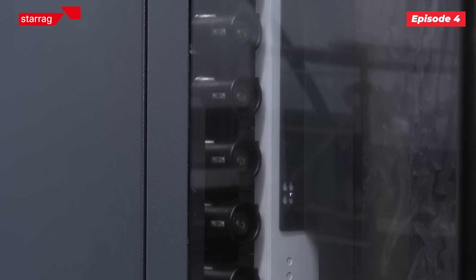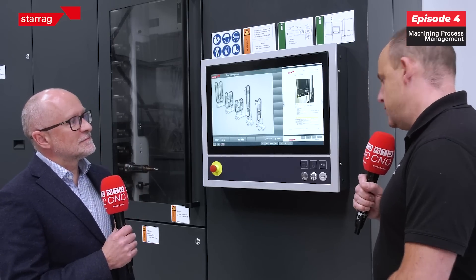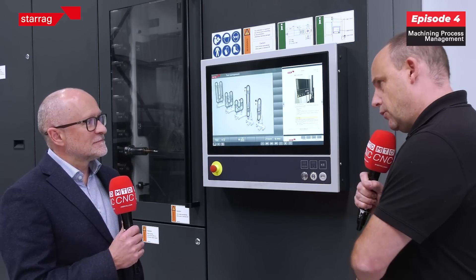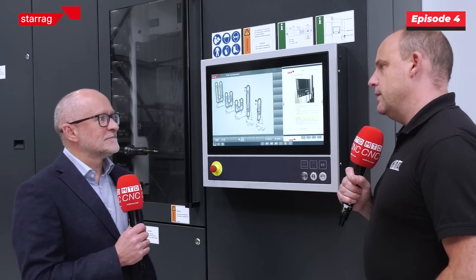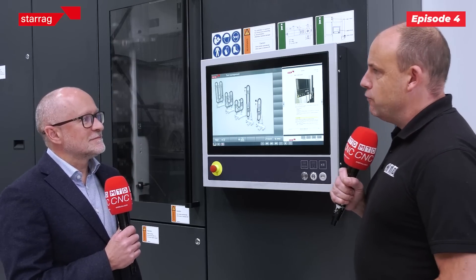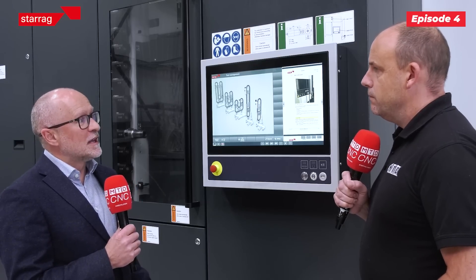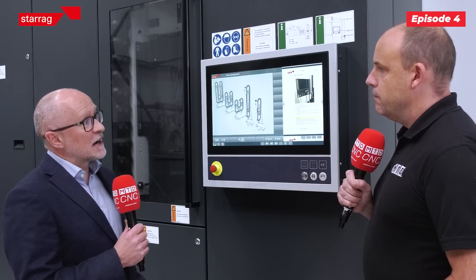It's all about ease of use, functionality, and continuous operation of the machine. Now we've got a lot of tools on this machine, and the recording of tool sizes is done through the ball chip — but what about fail safes to ensure that wrong tools aren't selected and accidents don't happen? That's why the chip system works so well: when you measure and set the tool, you're loading it with data that the machine reads. You're not relying on an operator punching numbers in and maybe putting a decimal point in the wrong place — the data is automatically carried to the machine.